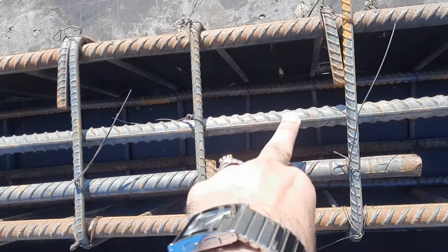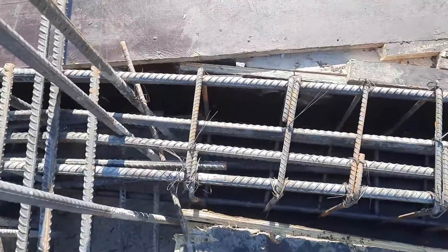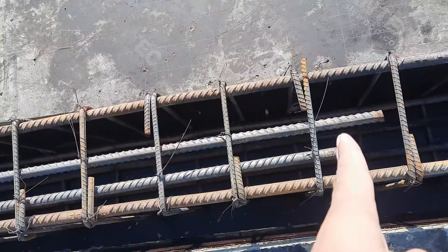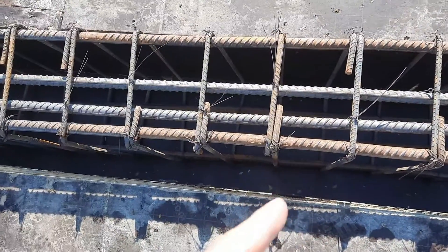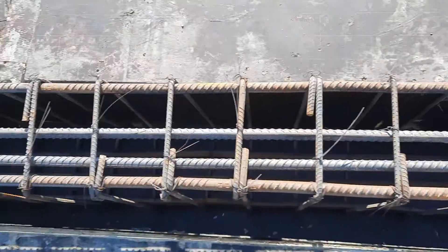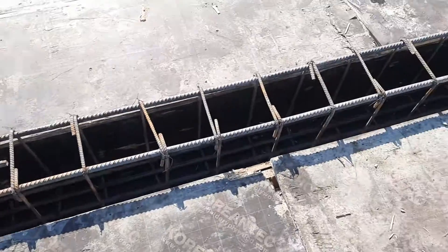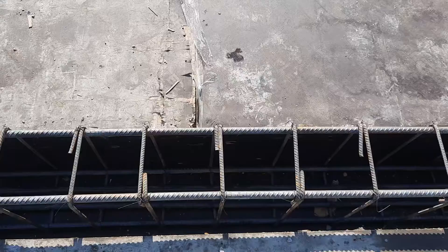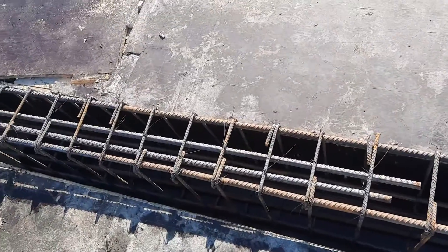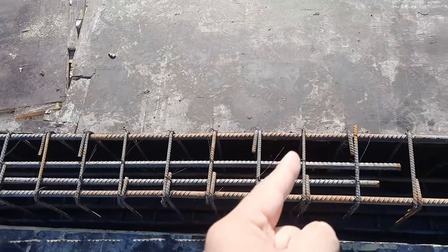If you are working on a construction site, be careful especially for these common things. Concrete cover is also very important to provide at the bottom of this beam. They didn't provide it yet, but after completion they will — however, sometimes they are not able to provide the concrete cover, so it should be fixed with steel reinforcement using binding wire. Concrete cover should be minimum 40 millimeter or 1.5 inches, especially for a commercial building.